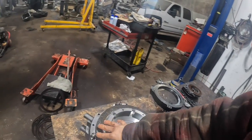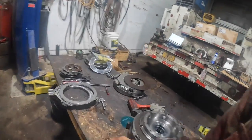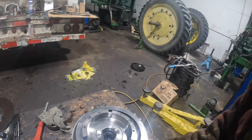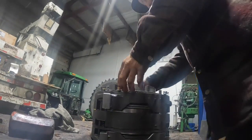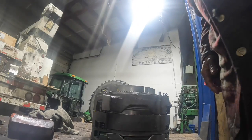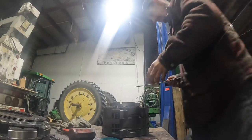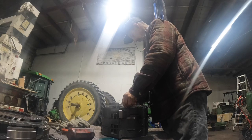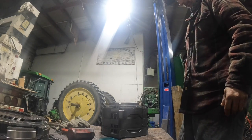This is the ring gear for C3. C3 actually stacks up in here. So we're not going to completely assemble it correctly right now because I need one more of these frictions. Another friction goes on top here. Hang on a second. I need 2 hands. What I'm going to do is just stick that one friction in there, put the separator plate in, and bolt it all together, and I'm just going to air check. At least I've got that far, and I know my cylinders, my seals are all okay and air checked as they're supposed to, like so.